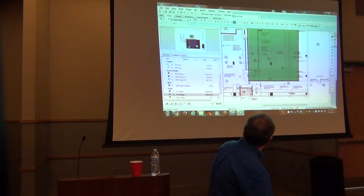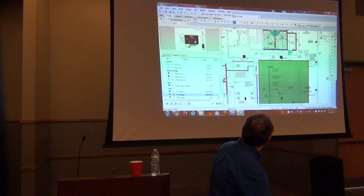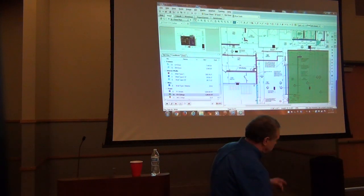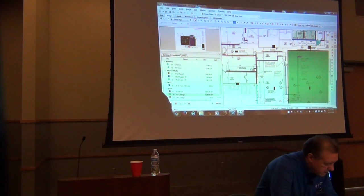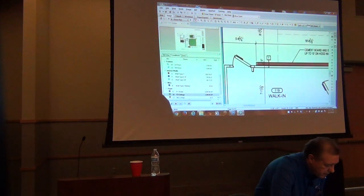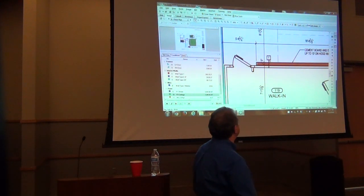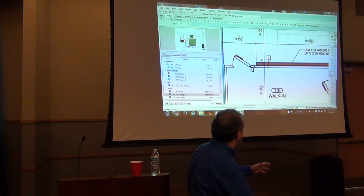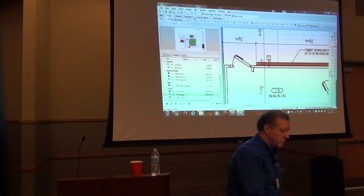A couple of other little things that are also interesting. On this page, they did give me a marker. And here we go again. Wall type 1. Now, I've already done the takeoff, but it would sure be nice to know if I missed any wall type 1. Now, that marker is fairly unique. It's a square box with a number in it, and this happens to be a semi-decent PDF. There's a function in on-screen takeoff called auto count. It's a search object recognition tool.